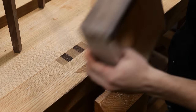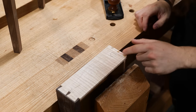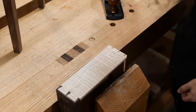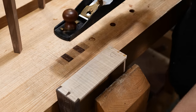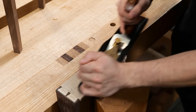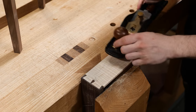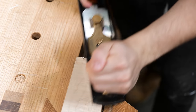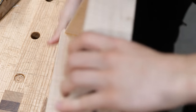I'm going to start on the back of the drawer because that's the bit that goes in first, then work towards the front. These tails are sitting ever so slightly proud of the end grain so I'll set the plane for a really light cut and get it all sitting flush. The only downside of a steeper angle like this is it doesn't shear through end grain as easily. I'm just going to reclamp this because it's wobbling a bit - that's better.